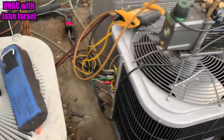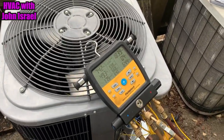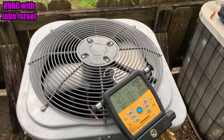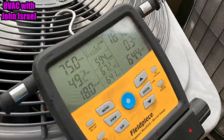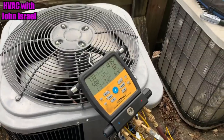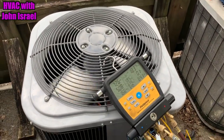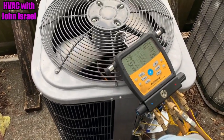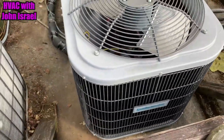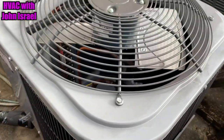Let this pull and then we're gonna start her up. All right guys, the little ton and a half ICP is up and running — it just started about three or four minutes ago. It's probably gonna need some gas because it's a pretty long line set. It's running nice and smooth and it's not very hot. It's a low outdoor dry bulb — only 59 degrees out here. The guy lives just a couple blocks from my house, so if I have to I can come back on a warm day and charge it, but I'll add to the line set so many ounces per extra foot. The job's complete. Looks good — as good as you can with all the sloppy line sets. Nice charge, done, cycled off.